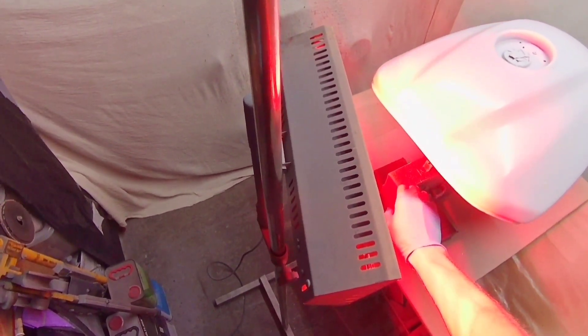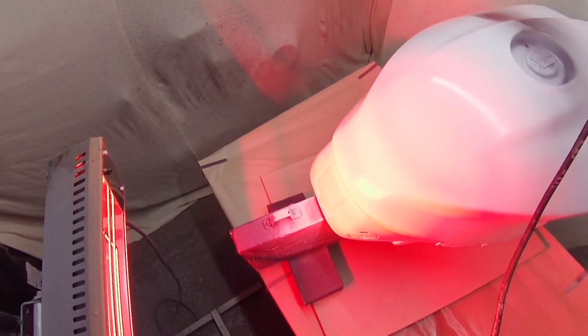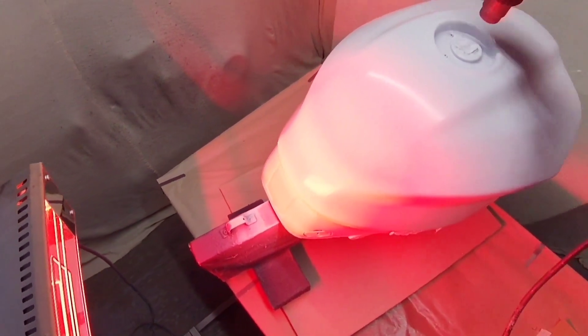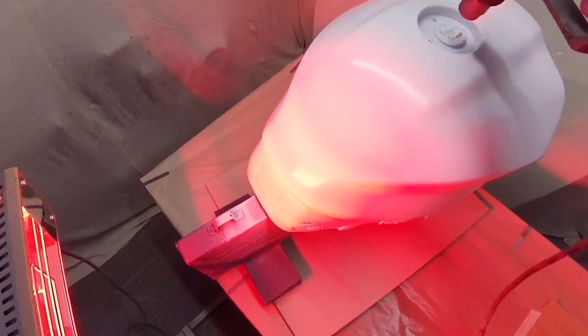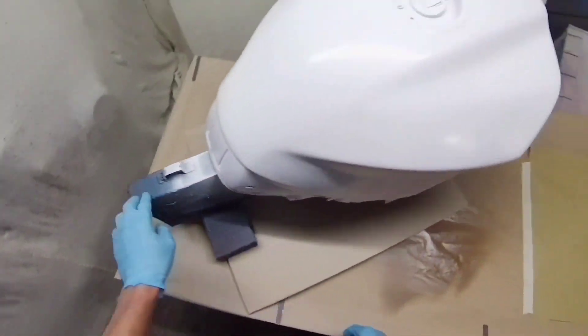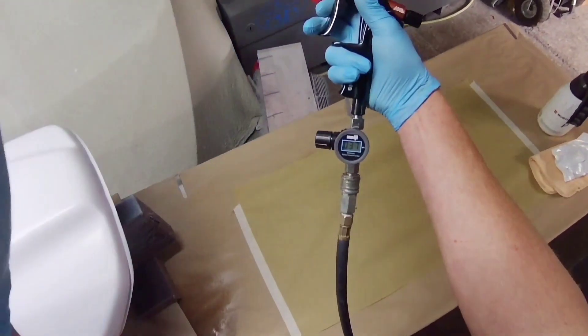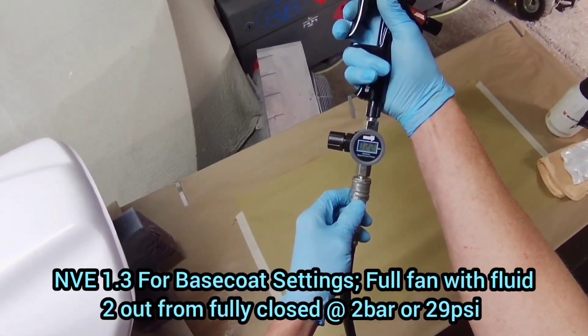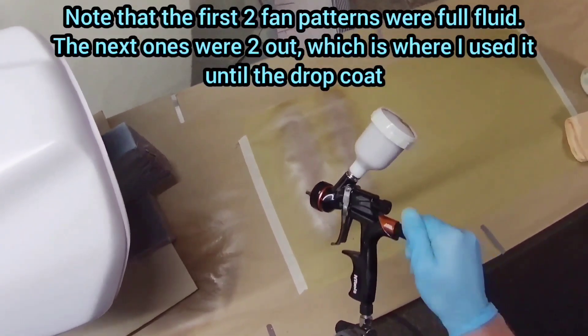I was pleasantly pleased when I used this because it actually sprays quite well. You'll see the pattern in a second — it gives a very good pattern, more of an 'I' than an 'O'. It's definitely different to the DeVilbiss GTI Pro Light copy they do, which is quite a heavy gun. I found that copy quite coarse — it gives a very small wet pattern with too much fluid going through the tip, effectively overwhelming the air coming through.